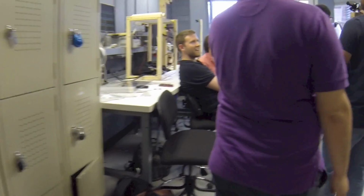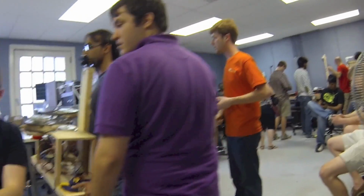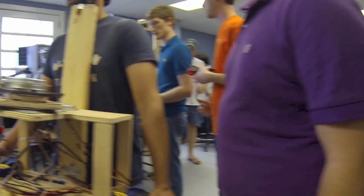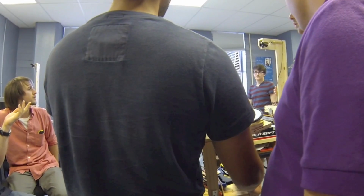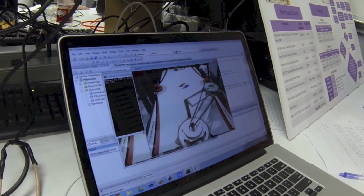Another design challenge we had to face was that the robot had to be mobile. This is why we spent more time and money using mostly aluminum and wood construction, because those two materials offered us the best strength-to-weight ratio. In addition, every electrical connection had to be soldered to ensure that the vibrations caused from movement and gameplay wouldn't short our system.